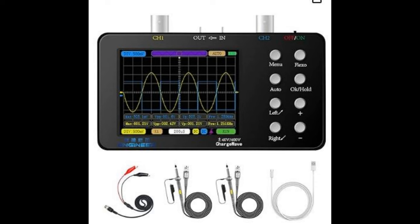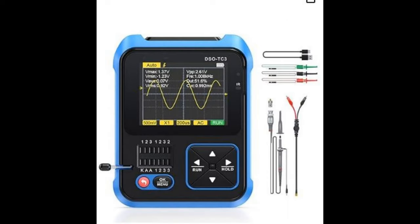So, there's one here for $50 on Amazon. Buy it. Signal generator. As long as it goes up to that frequency right there, up to 500 kilohertz, you're good to go. It's really not that hard, just buy the cheap ones. If you want to do some more investing, get into some higher values later on, you may have to upgrade. But if you just want to get in the door and get your Tesla coil running, that's all you need. With all that done right, this is what your final result should look like.